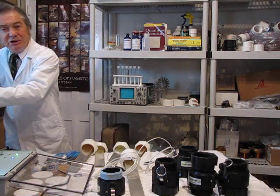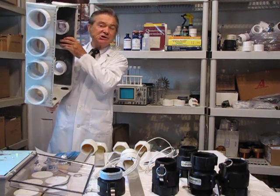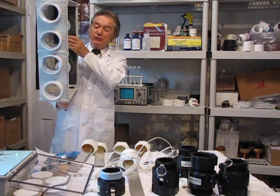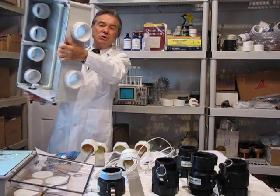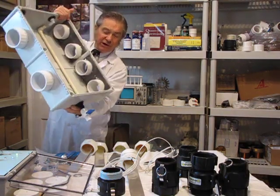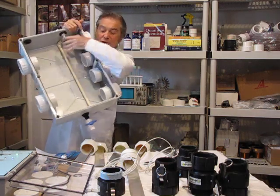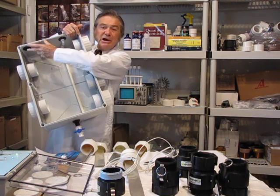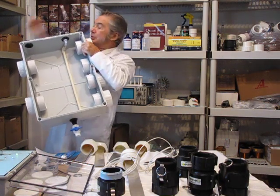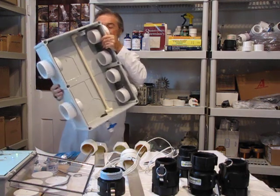The first item is the canister chamber — the charging chamber — with six cylinders, four on that side and two on this side, with an outlet tap that allows you to drain the chamber, and an inlet tap where the water starts at the bottom and goes up so that any air bubbles can be removed from the outlet tap.